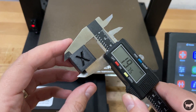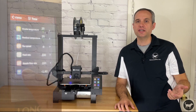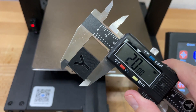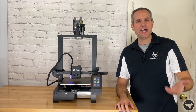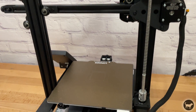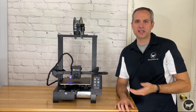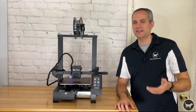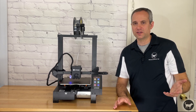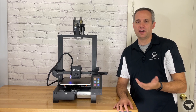The second thing I needed to adjust was the Z-height offset. After printing another calibration cube, I could see that I was just shy of the proper height, so I entered the difference into the Z-height offset, printed again, and got a perfect cube. If I had one wish for this machine, it would have been dual Z-lead screws, which would have eliminated at least some of those issues. But the LK5 Pro, with its larger work area, only has a single lead screw and has served me well, so I can't really complain.